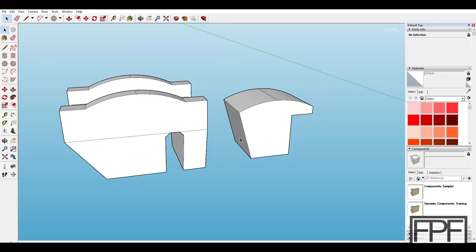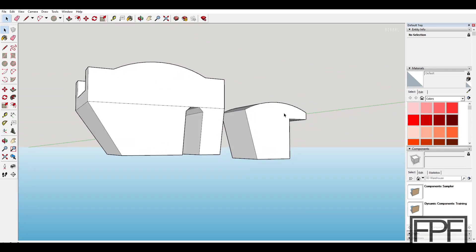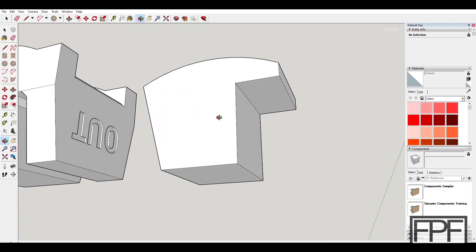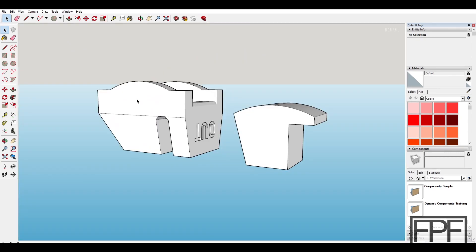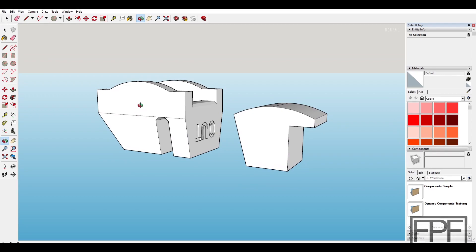Thanks for tuning in — this was a really fun one to do. I was a little disappointed in myself for how far off I was on the material characteristics, thinking that just TPU at a high infill was going to support the weight of the vehicle. But I feel like I redeemed myself switching to a two-part design and doing the structural part in PLA. Really impressed with how well this PLA held up under load. If I printed it at 100% infill I think it would probably carry five tons, but that's way more than what we need — this didn't begin to deform until about three and a half tons, which is well over the rating of the jack. If this is your first time here and you enjoyed this video, please consider subscribing. I put out a new video every Friday that solves a problem around the shop or house. Hit the like button as well — it really helps the channel grow. If you do subscribe, I will see you next Friday.